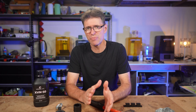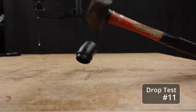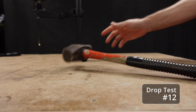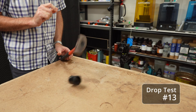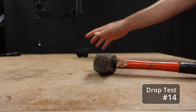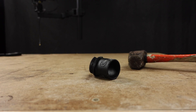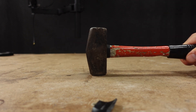In this particular test I repeated the drop 15 times because it was resisting the impacts really well. You can see that the resin doesn't crack or chip and only suffers some minor scuff marks. One of the key properties needed for this part is enough stiffness to hold its shape but also enough flex to withstand a sudden shock like you might expect in normal workshop usage. I'd say the performance here is excellent. It will break if you hit it hard enough, but this resin isn't claiming to be indestructible.